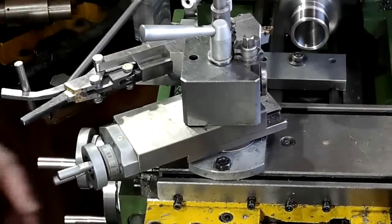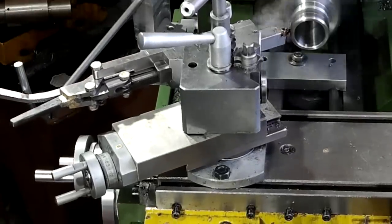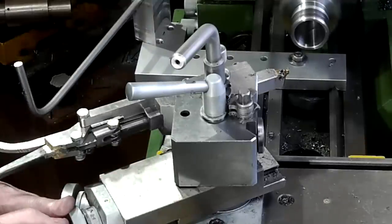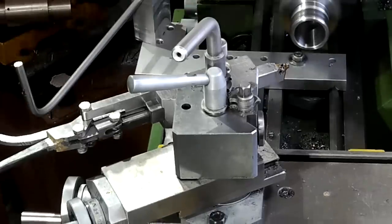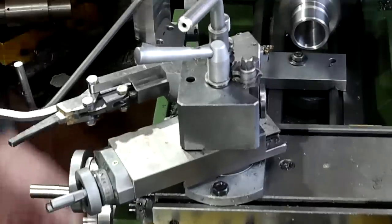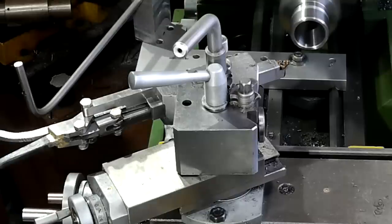The finish is wonderful but I soon found that I may have been pushing my luck a bit too far. I found myself wanting to use the tailstock with a live centre to steady the end of the workpiece just to prevent the chuck letting it go, but there wasn't anything to hold on to — so it was time to get my bodge thinking cap on to find a way round this.